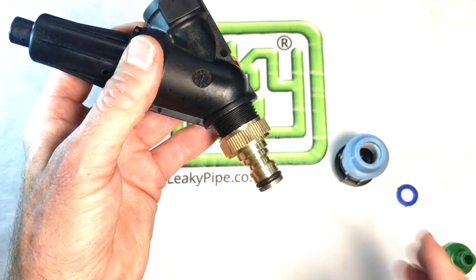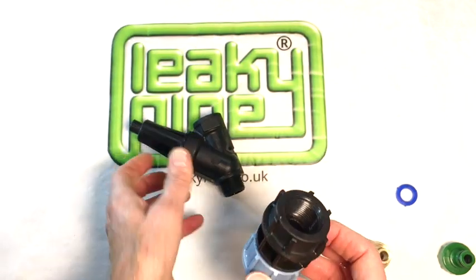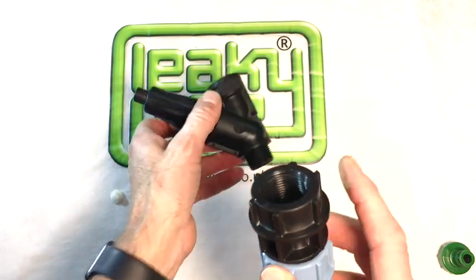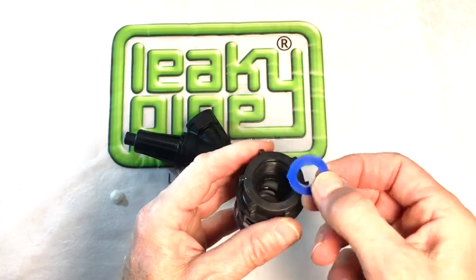Alternatively, we can remove the brass fitting and offer up our compression adapter if we're going to use polytubes connected directly to the pressure regulator. Here we've got the two male and female three-quarter inch threads that we can use PTFE tape on to seal.